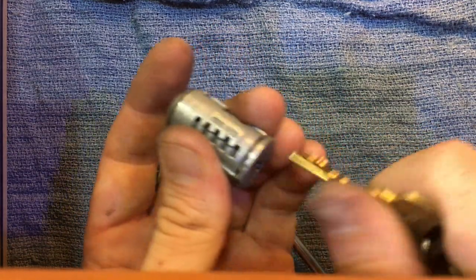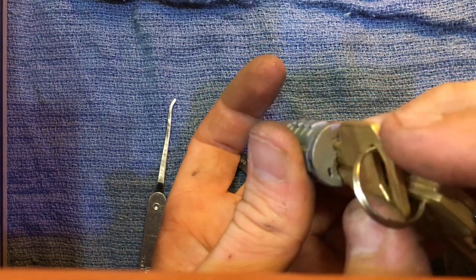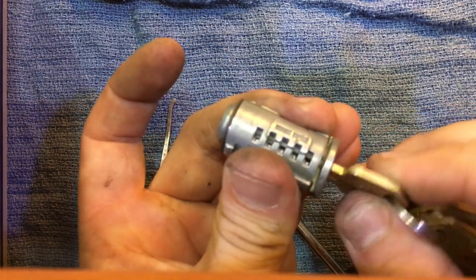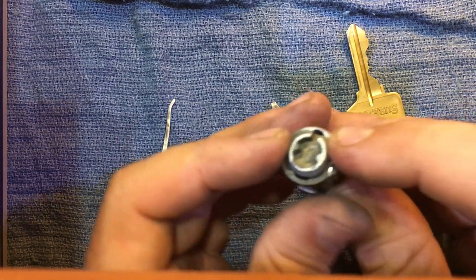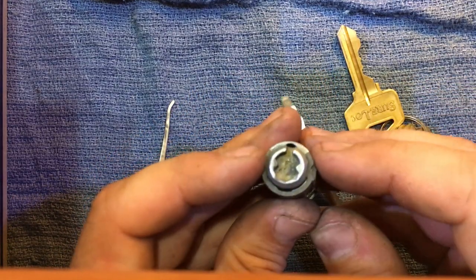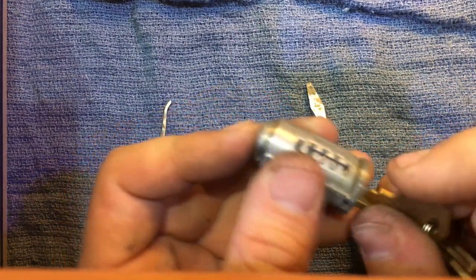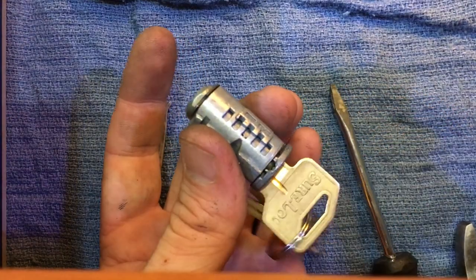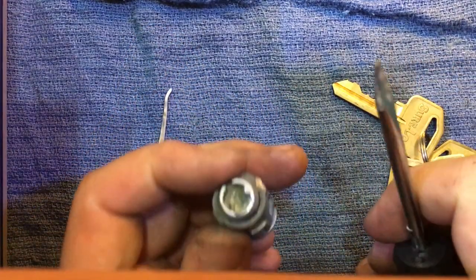It should work perfectly. At that point you've successfully re-keyed or fixed your SmartKey lock. As a helpful hint — if this clip is really loose and flopping around, if that ever comes off or works its way off, you're going to put your key in and this whole cylinder is going to come sliding out, basically ruining your lock. So as cheap insurance, just crimp these ends just a tad with a pair of pliers.